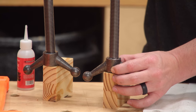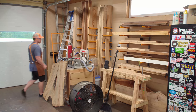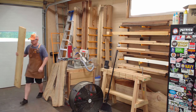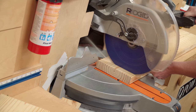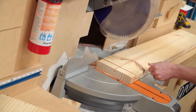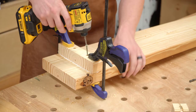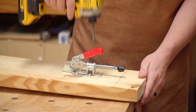While the glue dried on the leg assemblies I started on the lower shelf, and this shelf is incredibly simple. It's just a piece of 2x6 or 2x8 cut to overhang the lower stretchers by a couple of inches. One small off cut of the same board is also needed to act as a stop. The stop is glued and screwed in place on one end and a linear clamp is screwed in place on the other end.